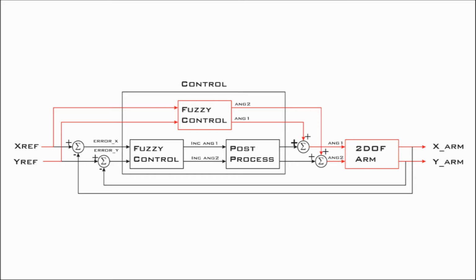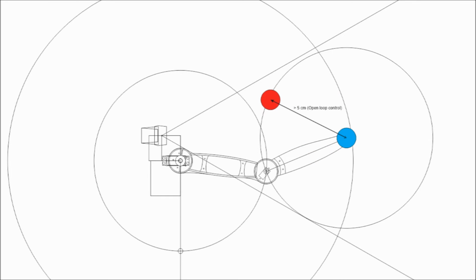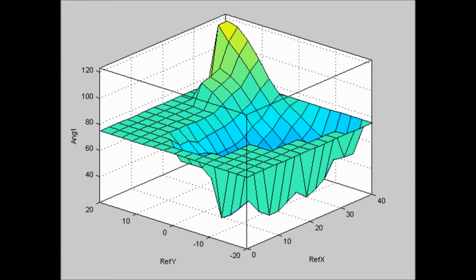The open-loop control allows the arm to be positioned very close to the reference object from the prior knowledge of the angles to be executed by the servos to achieve that position, taking into account thus nonlinearities presented by the system. The control executes the open-loop action if the distance between the reference object and the identifier is greater than 5 cm, otherwise it runs the closed loop, where the action is faster. And then when it is close enough, finer error correction is made.